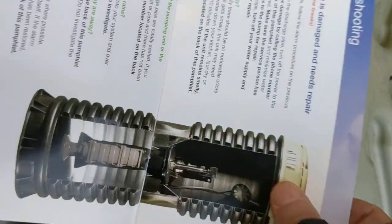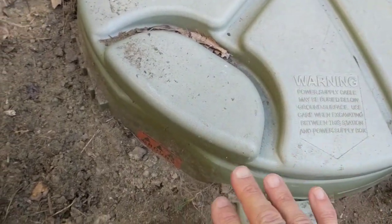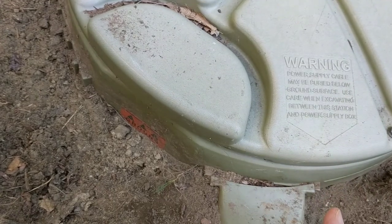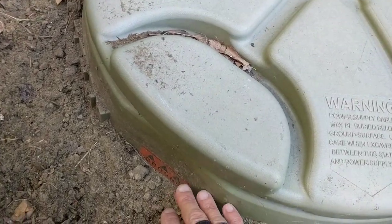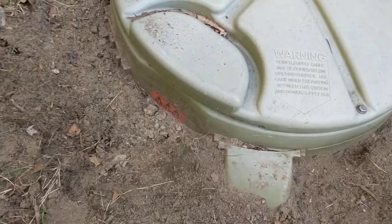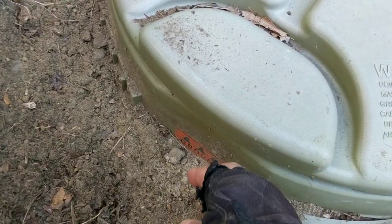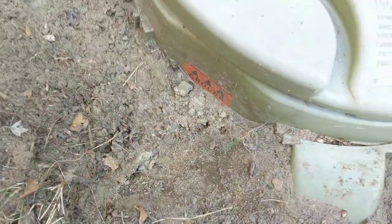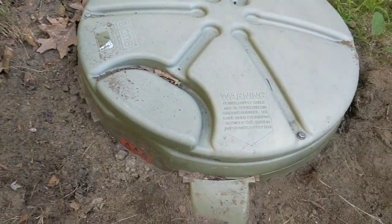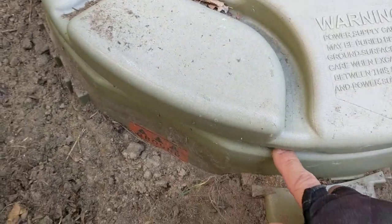Okay, now, one of the reasons why you don't want to have this covered with landscaping is that it needs to breathe. But honestly, the real reason for you is because you don't want a backup to fill into your drywall. E1 would never tell you that that could ever happen, but it can happen. So what we're going to do with Marlene here is add water from a hose right at this spot, and we're going to let it pool up until we can see it flowing away from the pump. And the idea is if the level does not come up to where the gasket would be, then it's going to be a pass. And this has never been done before, so let's just see what happens.